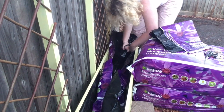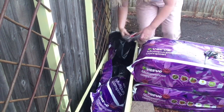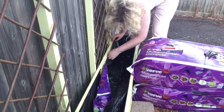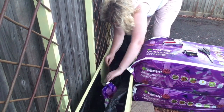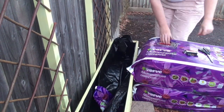Next we protect the wood on the inside by creating a plastic liner. I've got compost bags left over from projects over the last two years, which I've saved and cut up with scissors to make flat sheet plastic. I'm using my staple gun, folding down the edges of the plastic and forming it into a liner for the box, then staple gunning it directly into the wood.